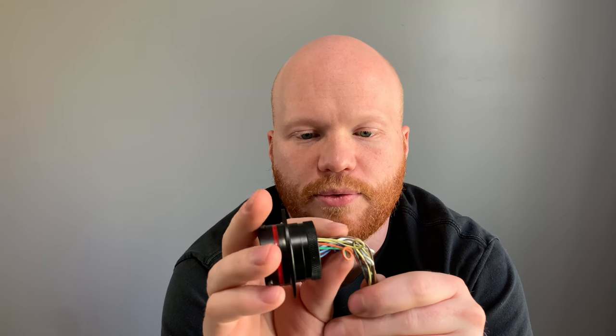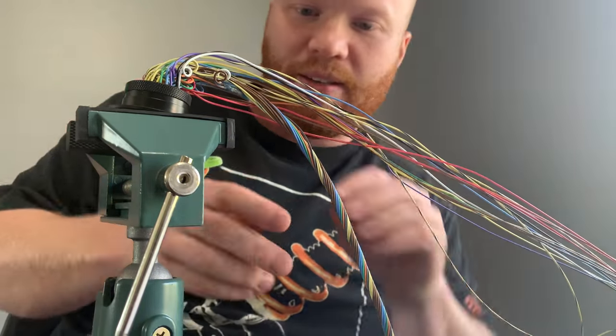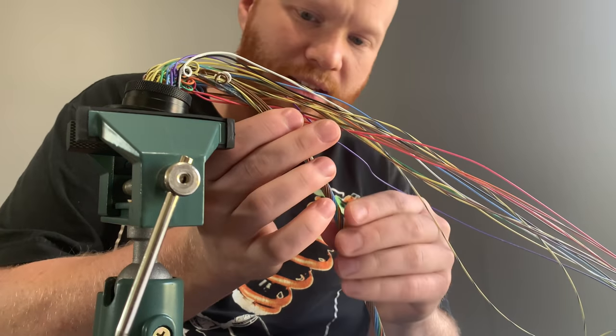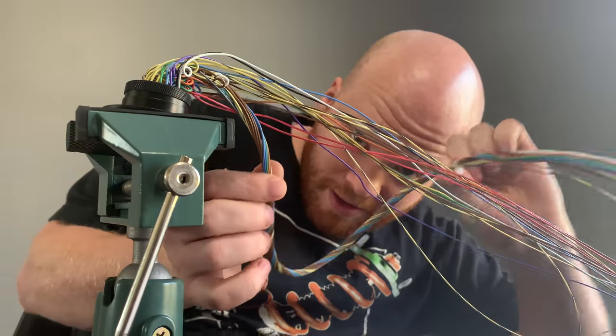So that's that. They do provide a little extra strain relief as well, just because they take all the bending out of the wire a little bit. So they function that way too, but they're primarily for if something needs to be repaired. So let's get this thing pinned up with 17 more wires, and we'll do our second layer. We have connectors pinned, our service loops made. I've slid the zip tie all the way down.